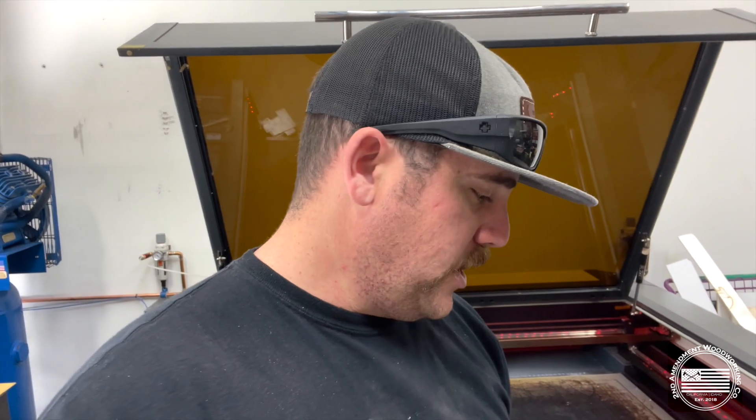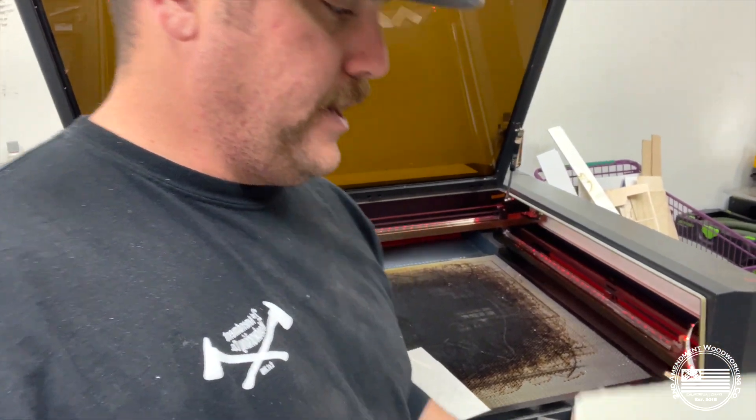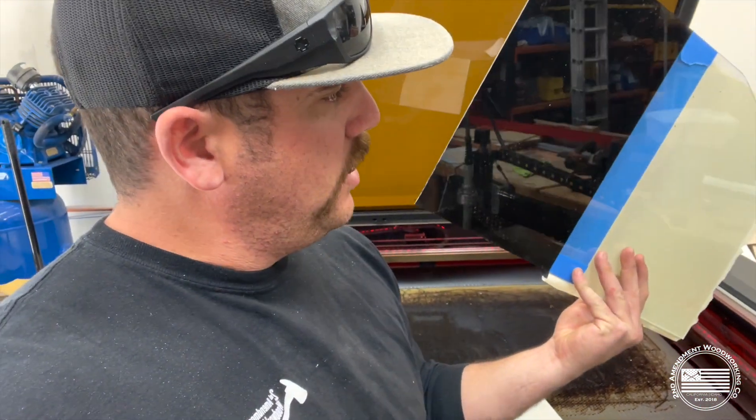Just made it back to the shop. I got some custom pieces of glass being cut — I tried to cut it myself but it was too marred on the side and had a bunch of little chips every time I tried, it shattered in millions of pieces. So I'm going to take a couple different prepped pieces of glass and see which technique has the best engraving. I have two pieces — one has just transfer tape used for vinyl application, which I heard usually has the best look. The next piece has transfer tape as well as high-heat paint. What I need to do in the software is flip my design because I want to engrave on the back, so on the front shiny side you end up seeing a mirrored image, and once it's in a shadow box no one can scratch or scrape off the paint. This is new to me doing this on just transfer tape and clear glass — I usually have to use paint as a medium. The laser is a lot higher power than what I'm used to, so this will be a first for me. Let's hope it comes out.